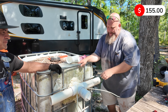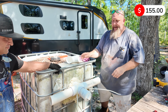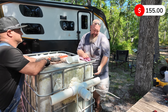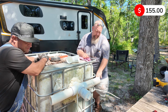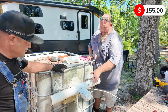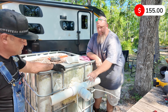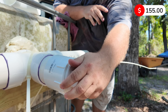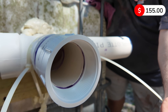As long as the drop pipe on the discharge side is lower than the inlet side, it'll work — because the solids in a septic tank float to the top. That's why your drop pipe goes down 18 inches: your liquid will come out the discharge side to your drain field. This is just a three-inch clean-out so if we ever had a problem with plugging, we can come in and clean it out.